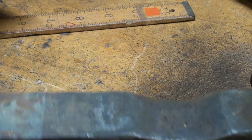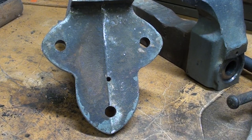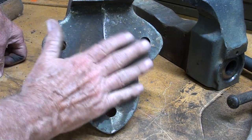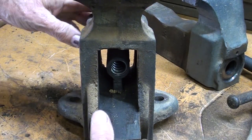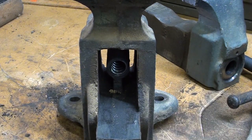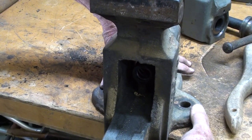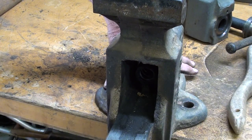I will just go ahead undaunted and live with it. One thing I do not like about the Parker vises — and it kind of shocks me considering what a precision company I considered them to be — they did not machine the bottom. Someone told me a horror story where they've seen these broken, pulled down with two bolts onto a bench with one of the ears broken off because of that. Because they don't really sit totally flat. On a wooden bench that doesn't make a whole lot of difference, but you can see where that could conceivably break off if you over-tighten them.